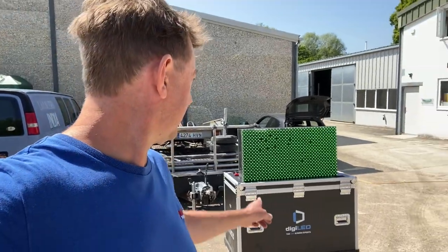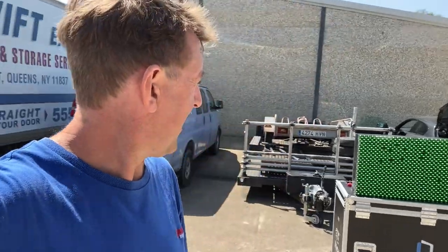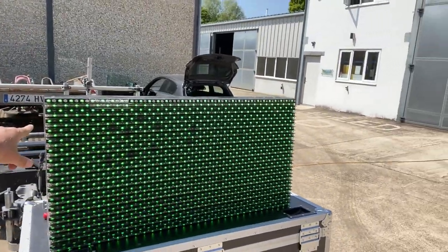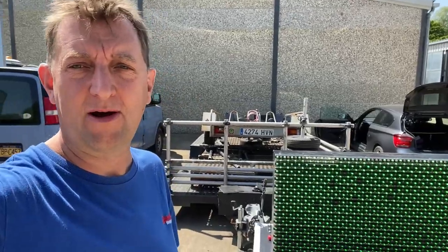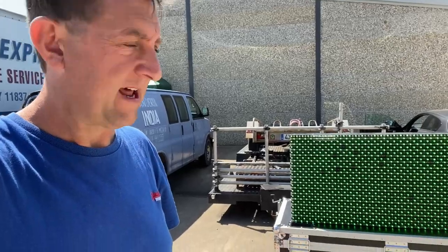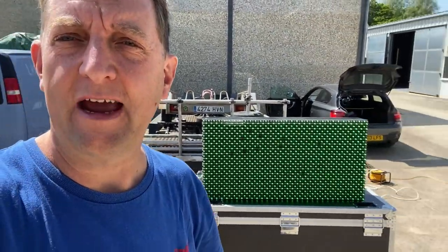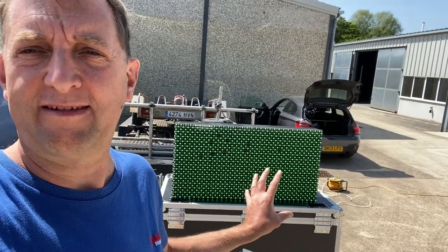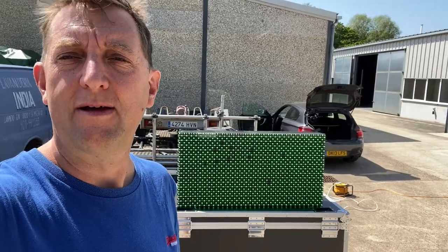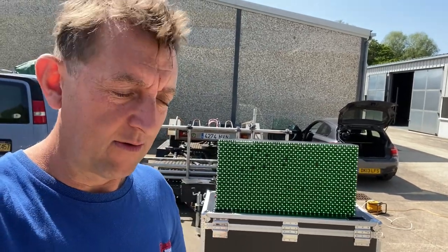I think I've got some pixels out on my screen. Yeah, it's not bad for 22 years old though. You can see the diamond pattern of the green pixel arrangement here. This diamond pattern combined with the human eye's sensitivity to greeny yellow colours was one of the things that helped enable the virtual pixel technologies, because this would give you the appearance of a brightness pixel map with a 15mm spacing, even though your video pixels were spaced on a 30mm.